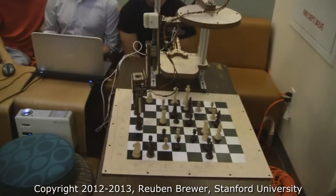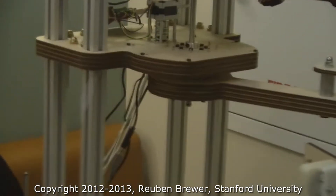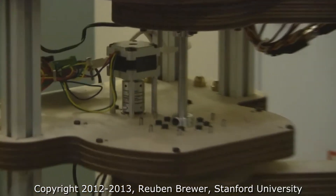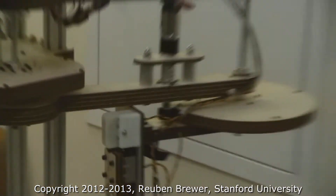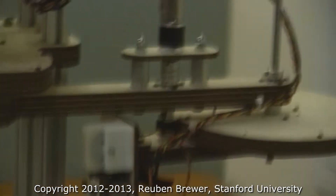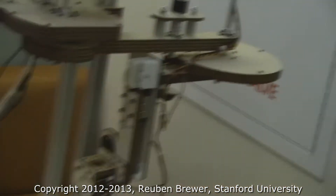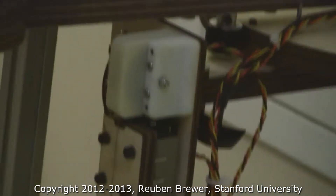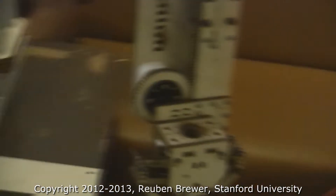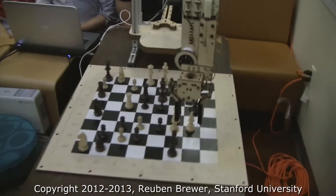Can you give me one more move? I want to capture all the action. So this shoulder is cable-driven by a stepper — flexible shaft coupler to cable. The elbow is a friction drive, custom made with O-rings. Then there's the linear prismatic, the linear guide. That spring box is gravity-compensating it — it's a constant force spring. And then they have a rack and pinion prismatic degree of freedom driven by a servo to the parallelogram bushing gripper.